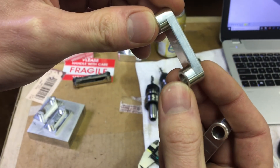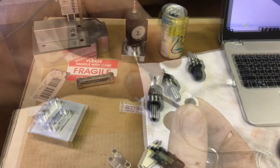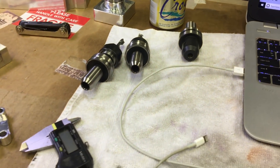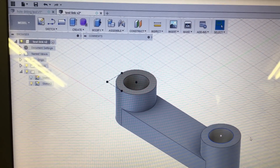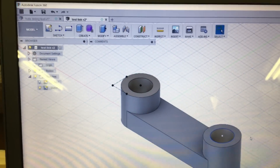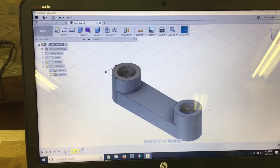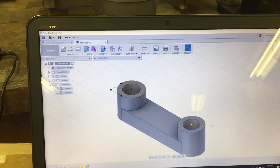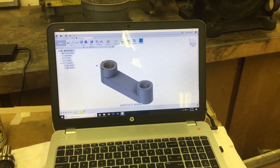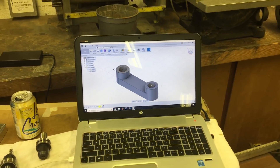There's still some work to be had with the lead-ins, but it was a really good learning experience. For my second ops I've just been drawing some construction lines in the sketch and then using those for my work coordinate system when I flip it over. I made the mistake of having it in the wrong spot — this is the second time I've done this. It worked the first time, but yeah, just one little oversight. Glad I was ready on the e-stop.